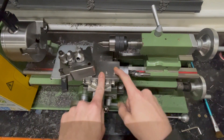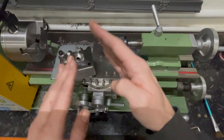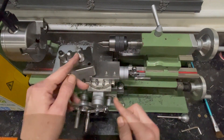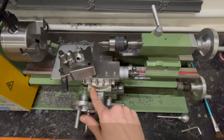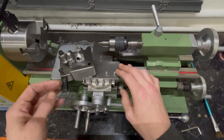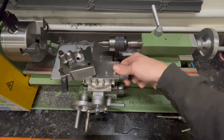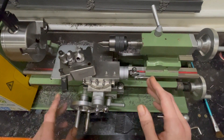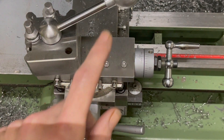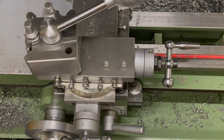This part is really for cutting angles — if you want to do a certain angle on a piece, you can turn this little bit here. You've got a degree indicator here. But the problem with mini lathes is that they're not very stable — there's slight play to them. So we're going to be making a metal block to take this away.